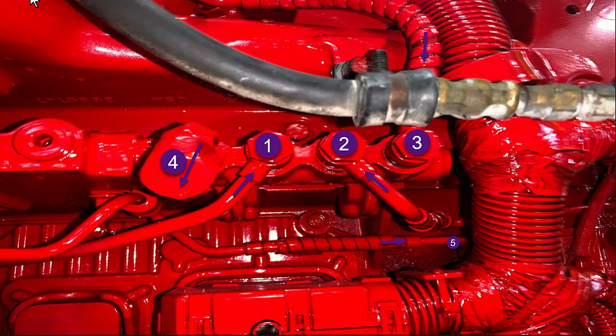If you get up to 180–190 mL, you probably need to start blocking off injectors in the rail with block-off tools — block one off at a time, check your flow for 60 seconds, and see where you are. When you hit the problematic injector, your flow will drop considerably, maybe down to 100 or even 80 mL. Typically you'd see around 100 cc's return from healthy injectors. Remember: if the connector isn't torqued properly, you can lose fuel at that joint — you might think it's the injector when it's actually the pinch tube, or connector, that the high-pressure fuel passes through to reach the injector.